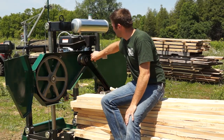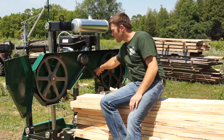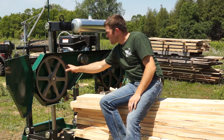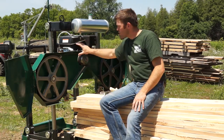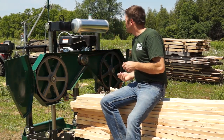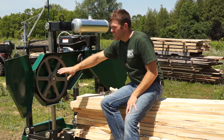The belts, again, these are just BX series belts. It's a cogged drive belt. This one runs loose as a tire to shake off the sawdust, and this one runs tight. The tension of this belt is governed by the engine, and the engine moves on a sliding plate. We also have to maintain and lubricate a few things on the machine, but not the bearings.